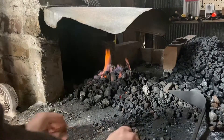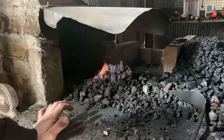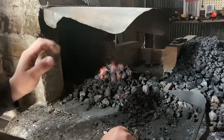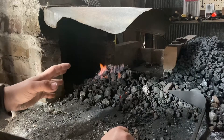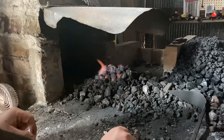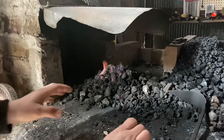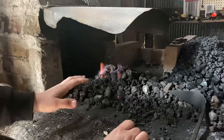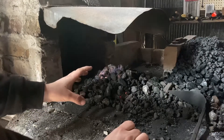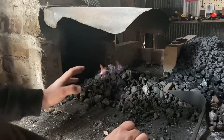I am running a mixture of coke and anthracite. This is purely because I was playing with some metallurgical grade coke and I'm not really liking it, so I'm just mixing it in with my regular anthracite to get rid of it. But this is good because tractor supply anthracite, like I'm running here, is what a lot of you have access to, and it will be the same for charcoal.